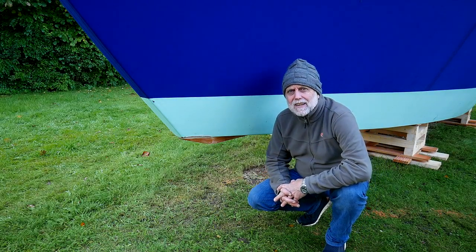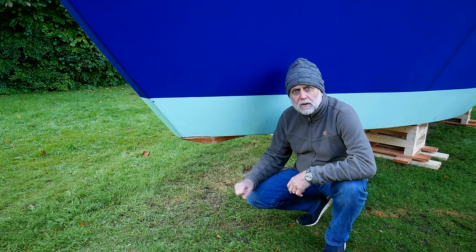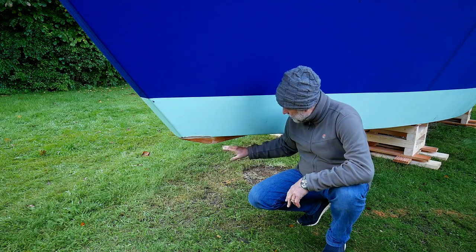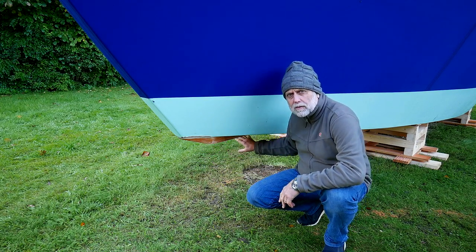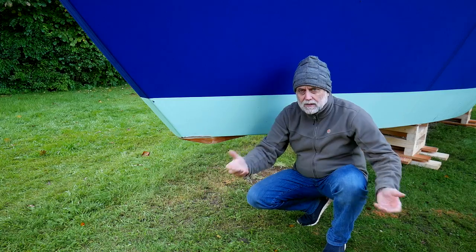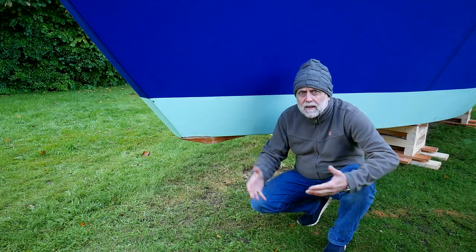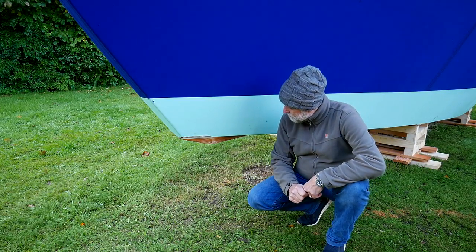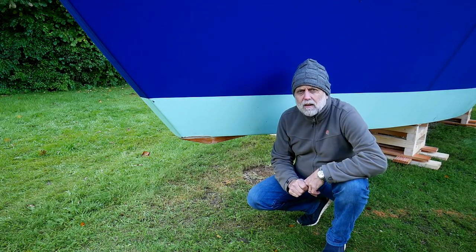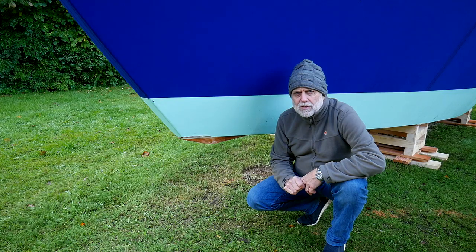There it is, the first little bit of keel. The epoxy is set off now, good and solid. On there, obviously, we're going to get another two pieces of this 6 centimeter thick wood to level her out. Same at the back, so we've got a flat piece running through, and then we can just put solid boards on after that, nice and easily, to get a flat surface there that the ballast keel bolts up to. Also been inside, lifted the floorboards up, started marking out the positions for the keel bolts, at least roughly at the moment. We'll be drilling them very soon, I think.